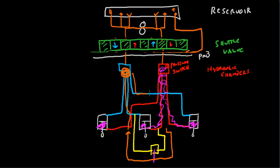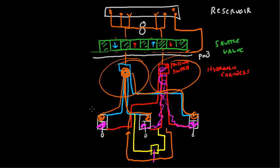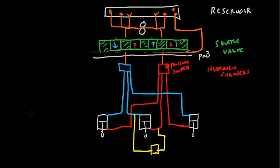Once it's here, it'll start getting distributed to the tops of the cylinders, essentially equalizing the pressure between low and high. When that happens, the gear is going to drop because of gravity and because of the additional pressure provided to it from the low pressure fluid. That's basically it. That's basically the PA-44 gear system. Yeah, there you go.